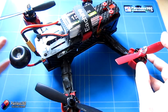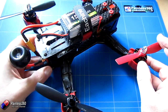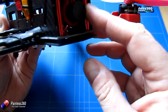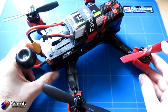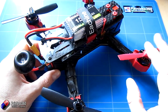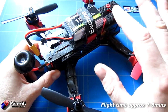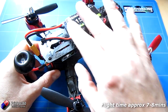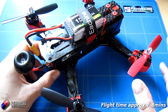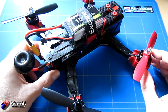Be aware that in countries requiring 25mW output you'll need an attenuator plugged into the back. The camera is okay and works fine for a first cheap FPV racer. The included battery is a 1500mAh pack — very much what the racing community uses: small, lightweight, just enough flight time to finish a race. Personally I'd probably use something slightly bigger.